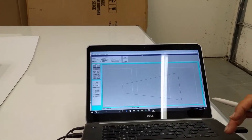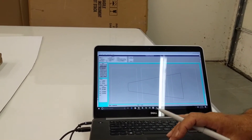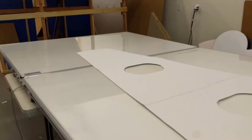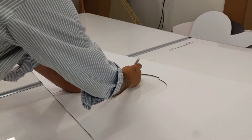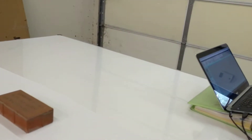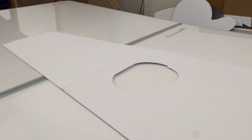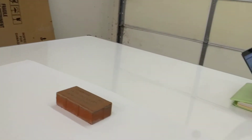Now I've got those inside holes. Again I'm going to do those with lines and arcs, so I click start. Then I come in here and I have a start with the line here, so I'm going to go from a line there to there and I have a line on the screen. Then I'm going to switch to arcs and then I come in here and I digitize the midpoint of the arc and the end point of the arc and I have an arc on the screen.